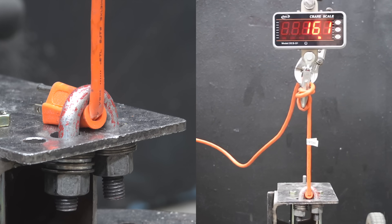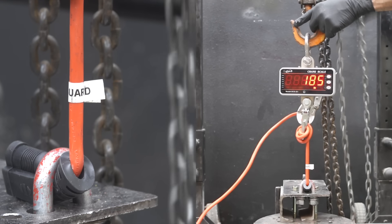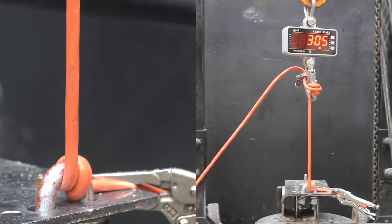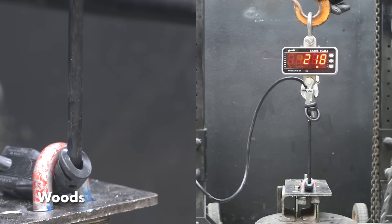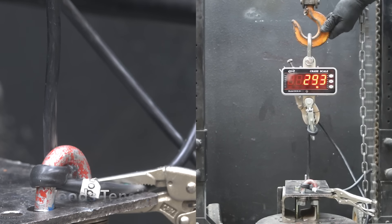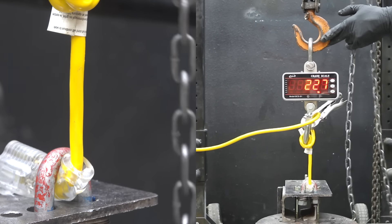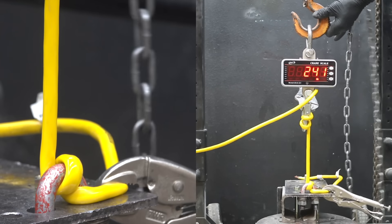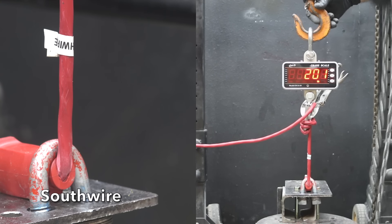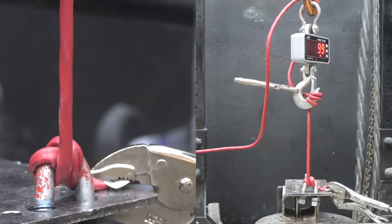Let's see how much force it takes to separate the plug from the cord. The 16-gauge Project Source cord broke before the plug separated at 190 pounds — a very well-attached cord end. The Harbor Freight Vanguard tore loose at 192 pounds. The 14-gauge Vanguard cord made it to 321 pounds before wires began breaking. The Woods moved into first place at 236 pounds before the cord end came loose, with a tensile strength of 334 pounds. The Yellow Jacket claims polymer filling for tensile strength, and it moved into the lead at 319 pounds before the cord end came loose, with an impressive tensile strength of 423 pounds. The Southwire finished 10 pounds better than the Vanguard at 202 pounds before cord separated from the plug, but gave up early on tensile strength at 241 pounds, moving into last place in the 14-gauge category.